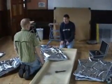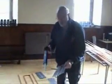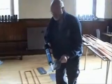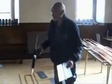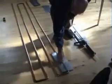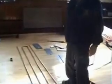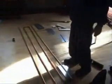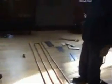Okay, and if we just give John the wee bits of piece of pipe. Right, along the bottom there, a continuous bead of the sealant along each of the pipe, each of the fins, and then you finish it on top, and then you stand it like that so it's really flat, and that should squeeze it tight. You do that with 6 here, 6 in the middle, 6 there, 6, so you have 24 fins per collector. So you'll end up with 24 fins on the grid.